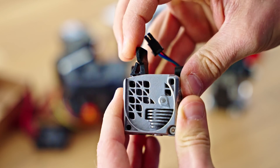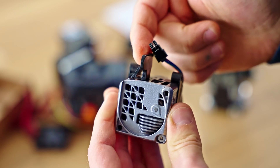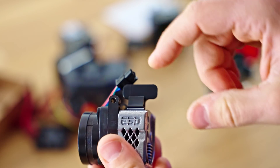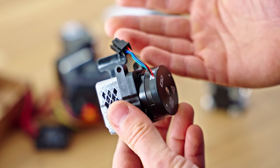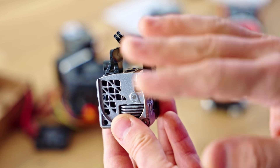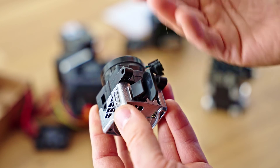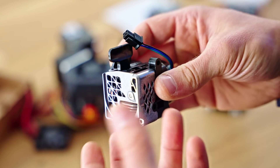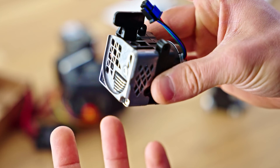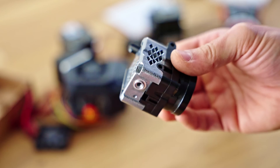I don't know if that's going to last — if you have this close and you yank on it, it just comes open, so that may be a weak point over time, but it could last. There is no more adjustment as far as filament tension goes, which honestly I am fine with, because I rarely adjust filament tensions — what the manufacturer presets usually is just perfect — and it just removes one error that the user could make. But some people might complain about this, and if you do, just get a different extruder. This is more of an as-light-and-compact-as-possible one, not one that has all the torque and all the features, even though it is pretty packed out when it comes to smart features.